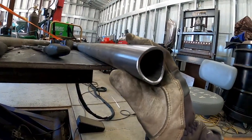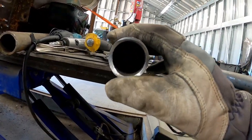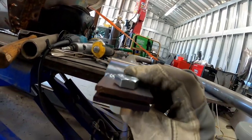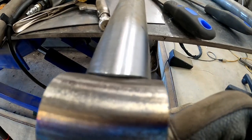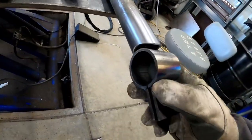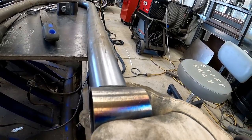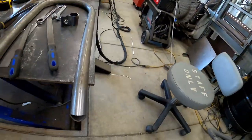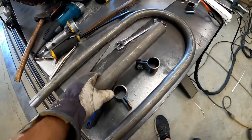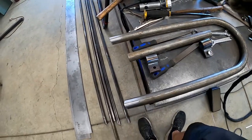I took the point completely down on both sides — that way once we lay our part in there to weld it gives us a better seam. It just creates a perfect little v-groove for the weld to sit into. I've got a piece of inch and a half tubing here I'm going to clamp both these clamps to and then we'll get it welded to the hoop.